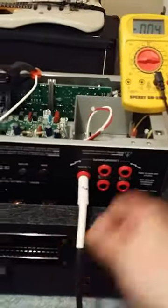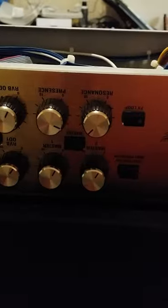What you want to do first is put the amp on, plug it in, put it on standby, and let it heat up maybe like 15 minutes or so. Make sure you got a speaker load on it — that is very important. Put your master volumes all the way down to zero. Zero them out, because if they're moved up you won't get the right reading. Make sure that is zero, the standby is off, and then just look at your meter.